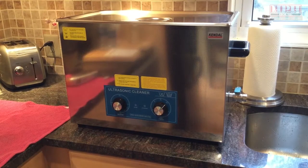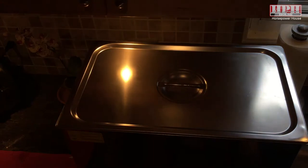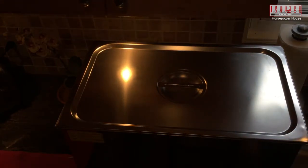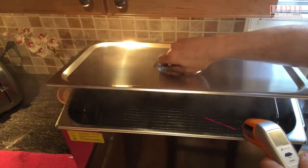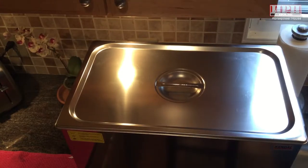The tank has its own timer but I've got a simple kitchen timer as well, because the way I'm doing this gives me the ability to test parts in the same cleaning session but at different times. If I want to do some for 10 minutes, take that container out, leave another one in for another 5 minutes. Temperature is looking at 154–155°F, which is around 66 degrees Celsius. Starting with 10 minutes.